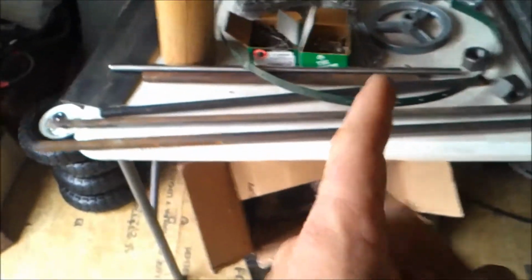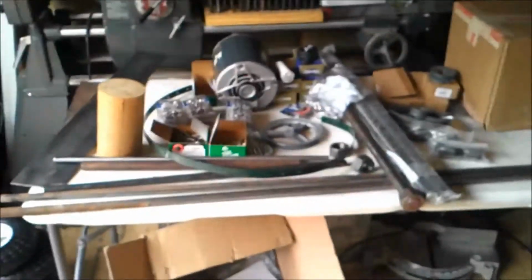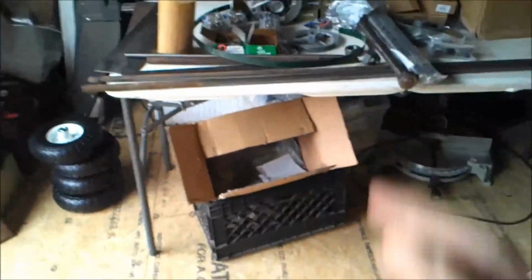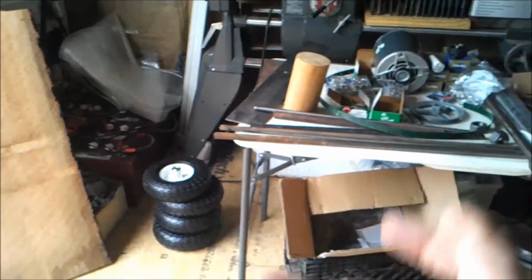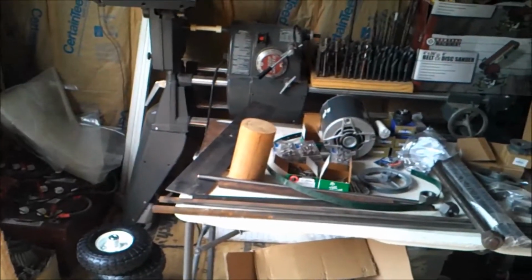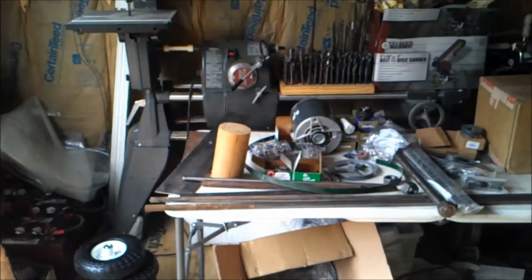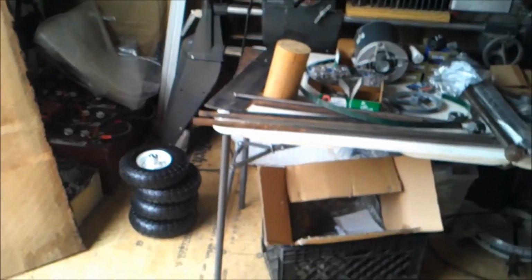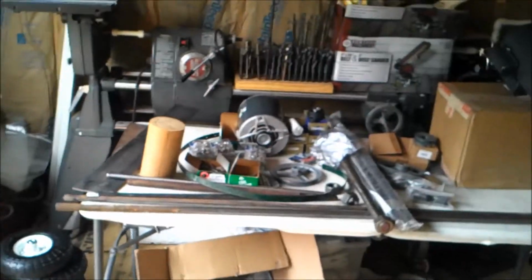So there will be essentially a power cord hooked up to it. I have yet to get the power cord material, but we want some good heavy duty kind of cord, so that it can handle being walked on and stepped on. And then we're definitely going to put a switch on it, out of one of those boxes. Because here's the thing: sometimes an apple will want to bind up the grinder barrel, and you'll need to shut it off in a hurry. You don't want to have to run way over yonder to unplug something when you're here working on this. You want to have your on-off switch right there, just in case there's an issue that requires it.